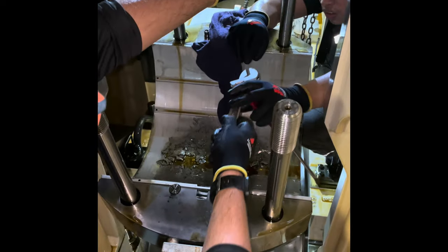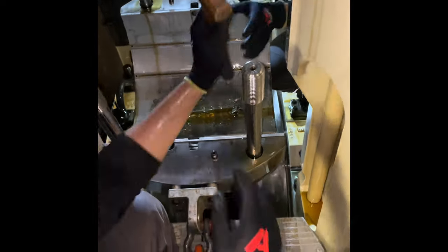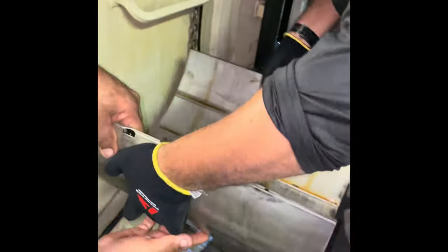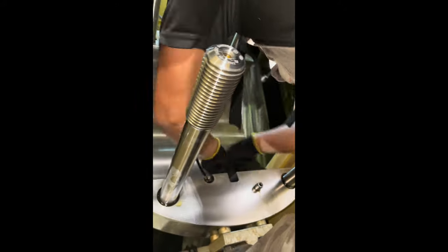Then remove the bearing locking align bolts on both sides of the bearings to take out the bearing. Then take out the bearing with a little blow on the other end using the Teflon hammer. And using Scotch-Brite, clean the bearing surface on the connecting rod and make sure that the lube oil passage to the crank pin bearing is clean and safe.